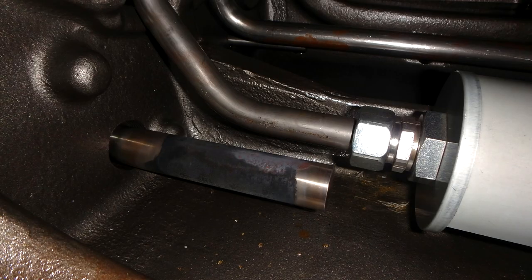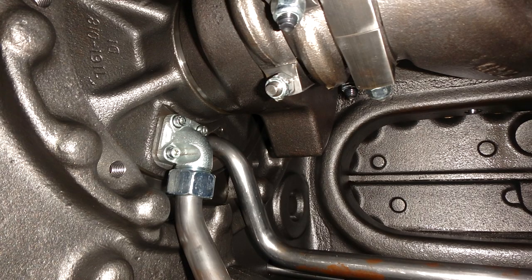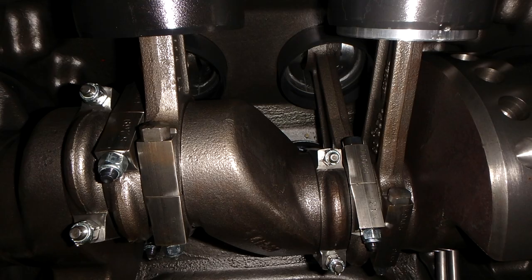This is the heater which is located on the oil sump. This is the suction filter. Here the pump suctions all the oil and delivers it to the friction parts, which are the connecting rods, the crankshaft, all around the pistons, the liners.